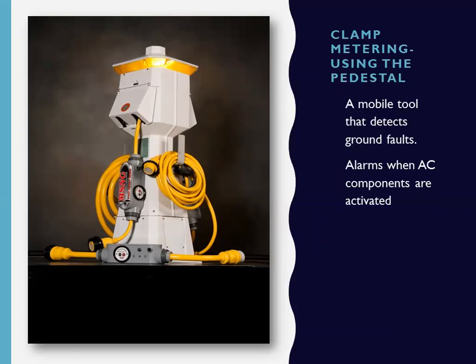to be drawn tight. So literally you install the sensor, and you twist the sensor to where your connection is preloaded, right? It's connected, but now it's preloaded because you don't have the opportunity of a seal ring ever at the connection end. I've never seen a pedestal that has a threaded connection at the pedestal end. So what the cable does is it holds it in place, it preloads the connection, it takes the weight off the connection, keeps it from falling in water, and hopefully it'll keep somebody from stealing it. So that cable does about four different things.